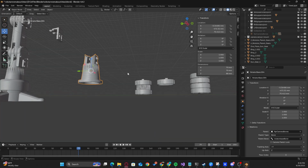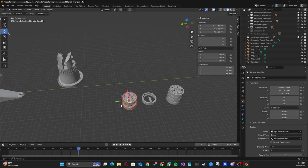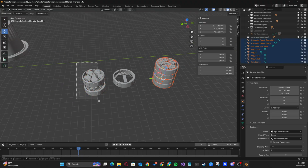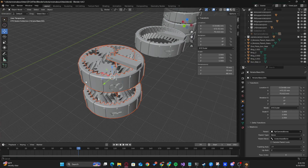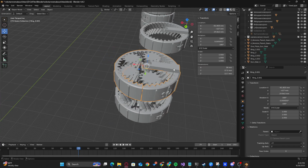Then for this one, you would have to use the 3-layer planetary gear model, not the 4. The 4 is for the rest, but for the base it's going to be 3. I had to customize this to include the attachment for the magnet. I'm going to tell you right now, it's going to be a bit hard because this might break off or that might break off. It's okay, that's fine. It's good to use super glue on the middle right there for the magnet.